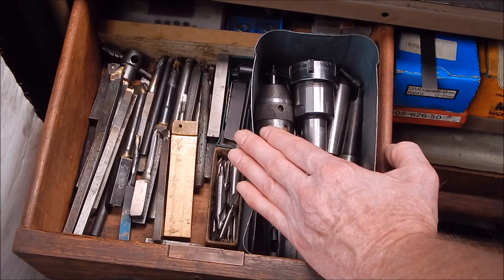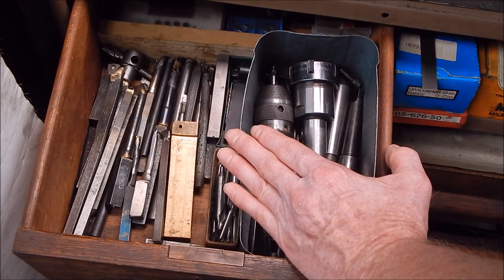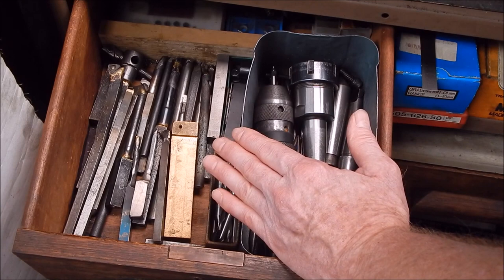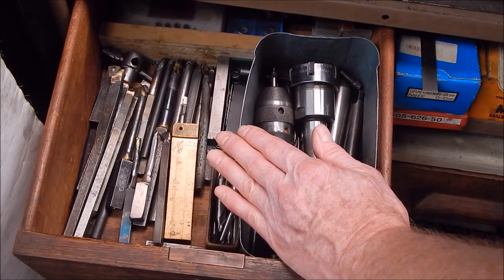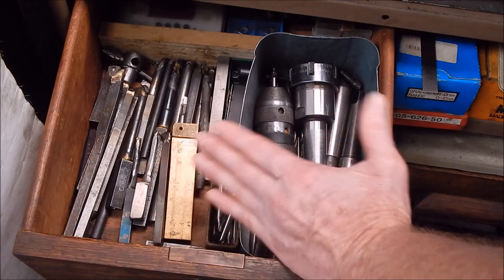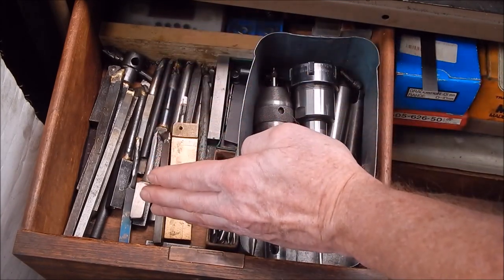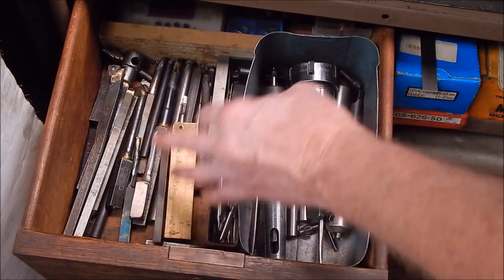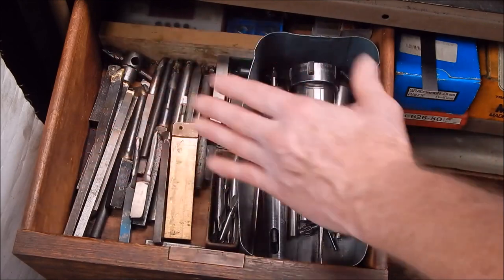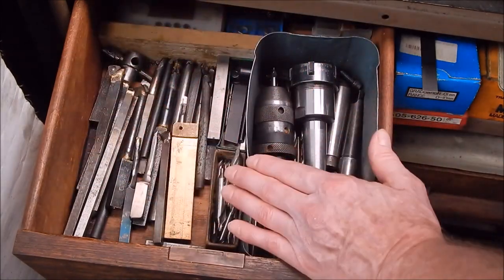And going back a while, I did a video showing how you can braze steel to steel or whatever using plain copper electrical wire. And that video got a lot of hits. A lot of people were very interested. You can do it with a gas torch that's suitably hot, or you can do it with TIG, and it worked good. I had bronze on one end, copper on the other end. I load tested the whole thing and neither end gave out. Both of them held up, and the metal in the middle just all screwed up and twisted like wrought iron.